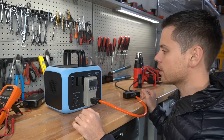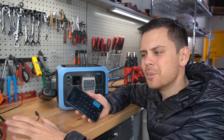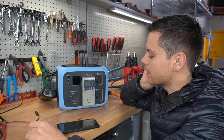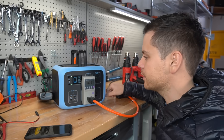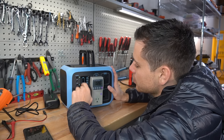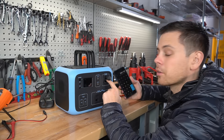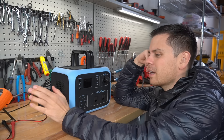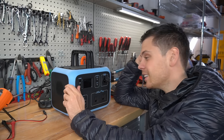The test is done — I wasn't here when it finished — and we only got 250 watt-hours. That's not very good. Even at that discharge rate with this chemistry it should produce a higher number. I tried to get more capacity out of it, but we still have 250 watt-hours — it shows zero percent state of charge. I was expecting at worst 400 watt-hours, which would mean an 80% efficient inverter. But 50%? That's pretty bad.